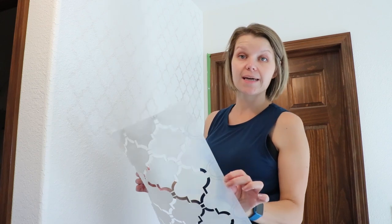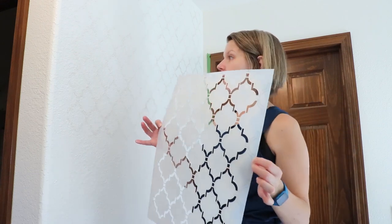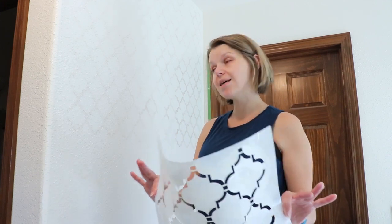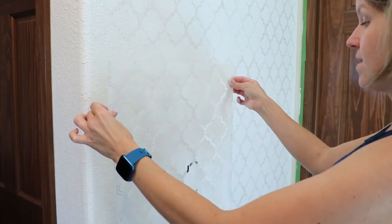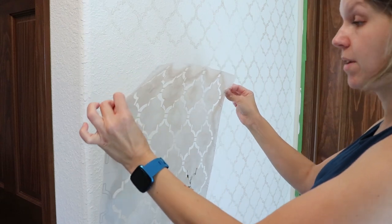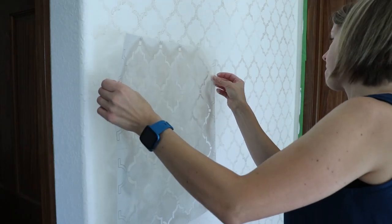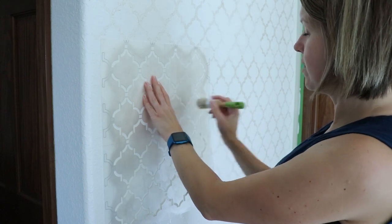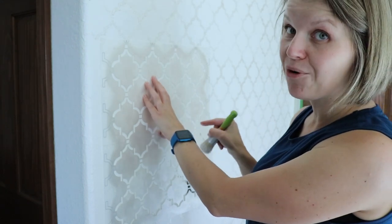My stencil is starting to lose a little bit of stick on the back, and every now and then it's a good idea to wipe off the back of the stencil in case any paint has come up through the edge or overlapped. So I'm going to take this down to the floor, flip it over face side down, and just wipe it off with a wet paper towel, let it dry, reapply the adhesive, and keep going. To cover up this light fixture, I'm just going to put the stencil over it — I've just reapplied adhesive and I'm going to stick it really well to the wall. For this piece I'm going to hold it on with my hands because it doesn't have the best adhesion right at that light switch. The other option would be to cut around the stencil, but I want to use this on another wall so I'm not ready to cut it apart just yet.